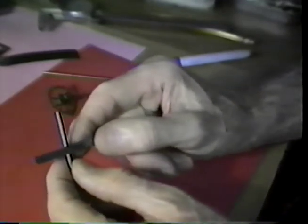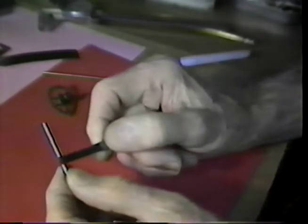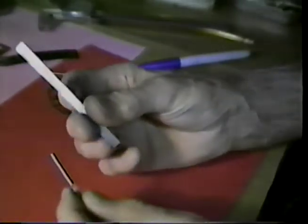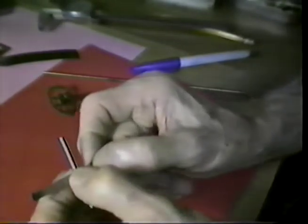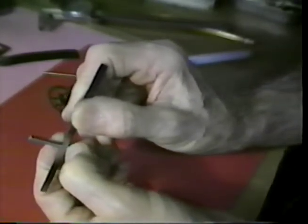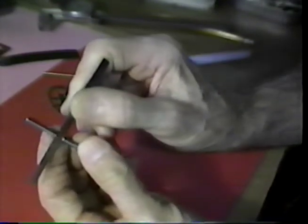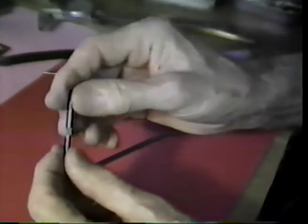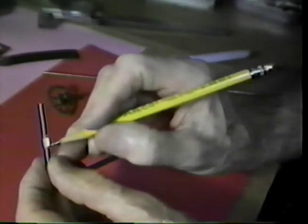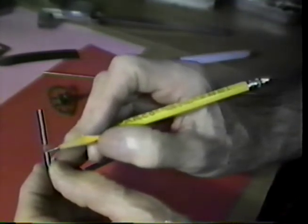The rod is 125 thousandths of an inch, so that says that the distance that's removed is 62 or 63 thousandths of an inch. This material is 35 or 40 thousandths of an inch, so when we sit this in the pocket, we find that the rod overhangs the surface of the material by about 20 thousandths of an inch. The second thing that we did here, away from the pocket, about 1 millimeter away, that's about 40 thousandths of an inch if you're measuring in the English system,